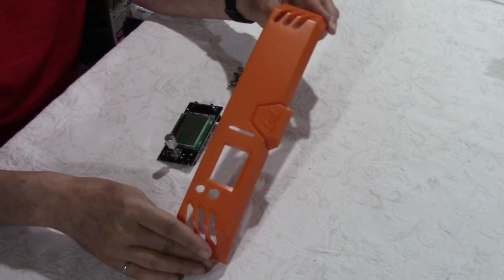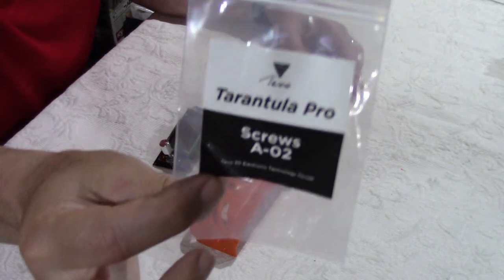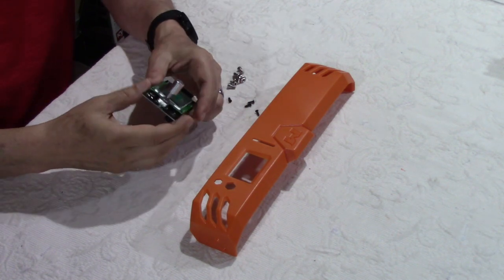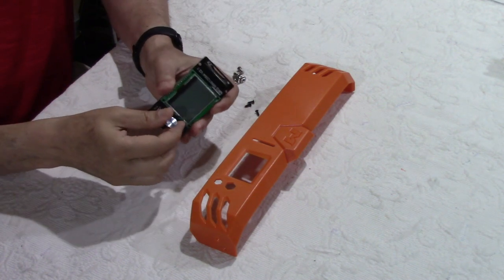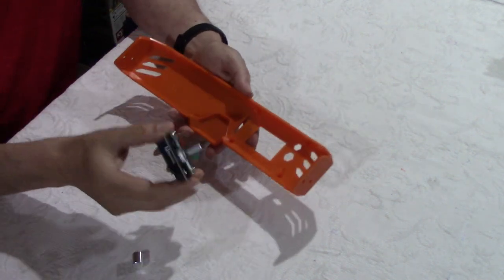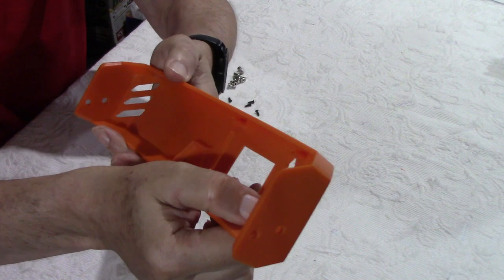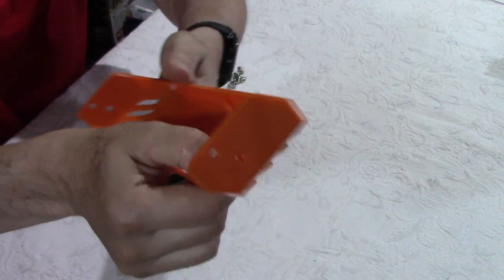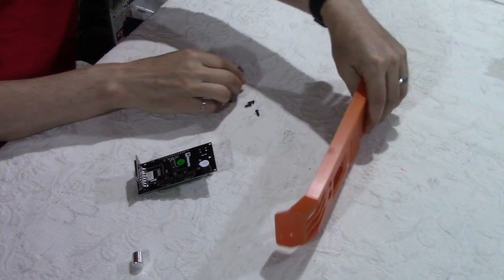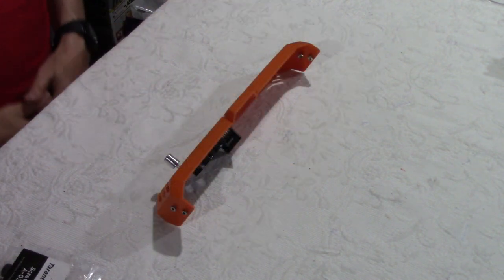For the next step, we put the frame on the side and use the front plate and display from bag A02. We have small black screws to tighten the display onto the plate. We remove the knob and insert the display at the back — this is easier because we don't need risers like in the previous version. The plastic mold here has risers built in, and we use silver screws for the two sides with T-nuts.